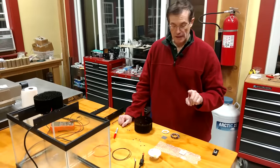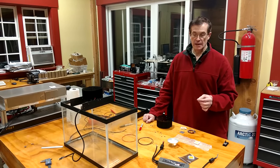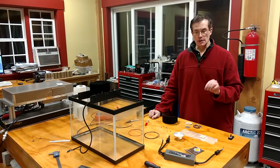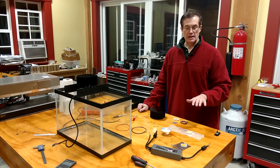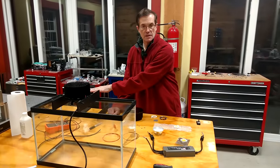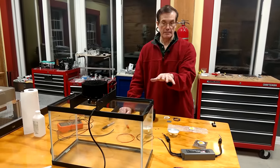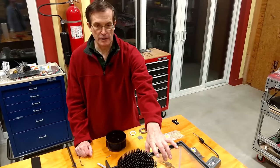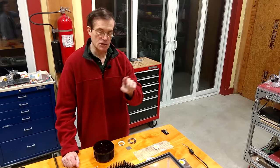They do provide drivers, but I didn't get mine from them because I wanted something a little different. If you want the most lumens per dollar, you can assemble the diodes in series — each one has about a 36-volt drop — so you can get drivers that provide between 200 and 300 volts DC to power as many as six or seven lights in series. However, since I'm mounting this above an aquarium and it would be running a couple of amps, 250 volts at a couple of amps above water is not safe, so I opted for an individual driver at about 36 volts per light.